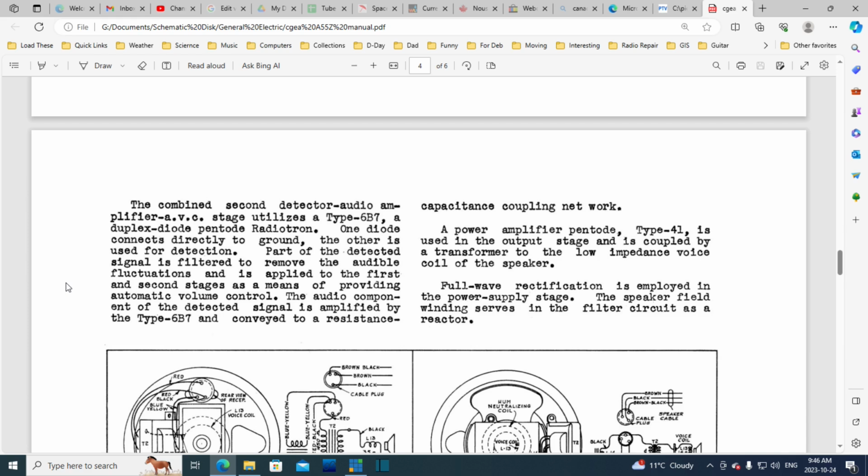So just about every radio does this, because the output from the IF, once it's detected, which really means rectified, you end up with, guess what, a rectified DC voltage sitting there, and that voltage is varying with the audio signal. So what they're trying to do here is filter out that audio variation and use the voltage to control the amplification at the start of the radio. Stronger signal, less amplification, and it throttles the radio's sensitivity in accordance with the strength of the signal being received.